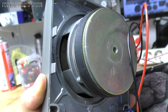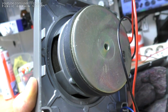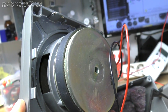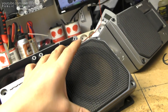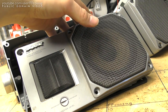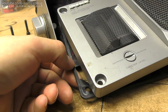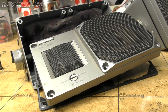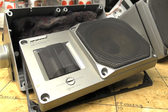They do seem to have a foam surround which hasn't gone bad yet, even though these are mid-80s speakers. I'm not going to touch that. It's foam from behind, so refoaming this is going to be a real problem when it does need to be done — you'd have to get the front grille off. The tweeter is mated to the woofer — what an amazing design. It's gasketed with a very hard rubber gasket. I'm just going to clean the pot and do the same on the other one. That's an amazing design.